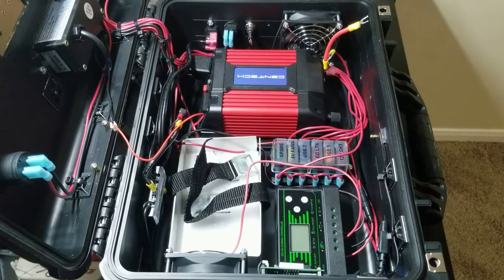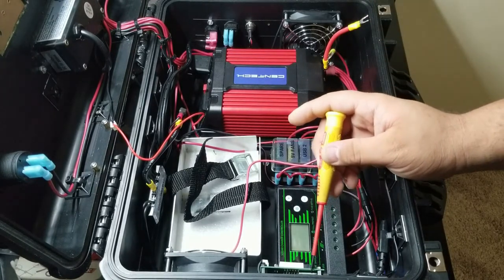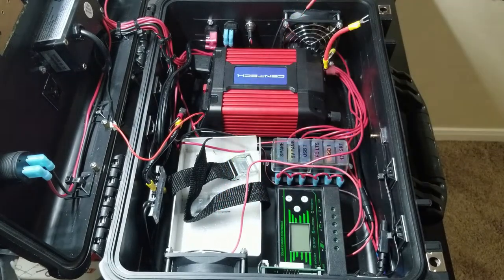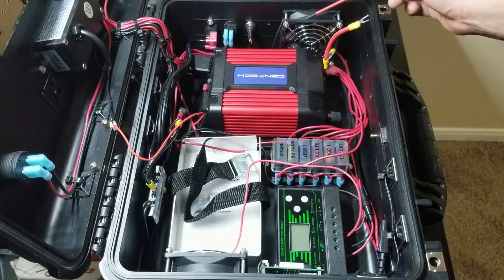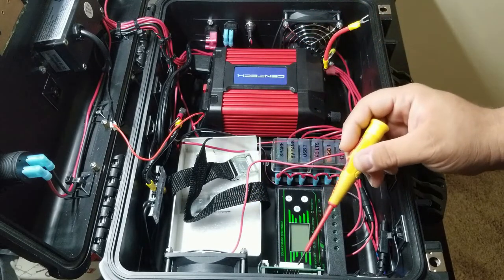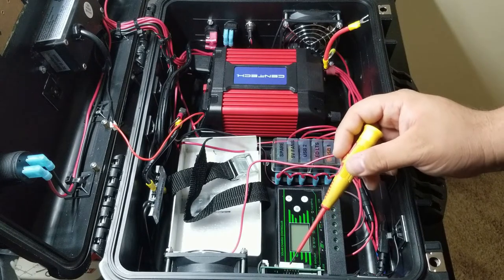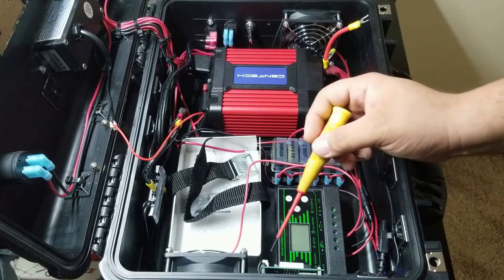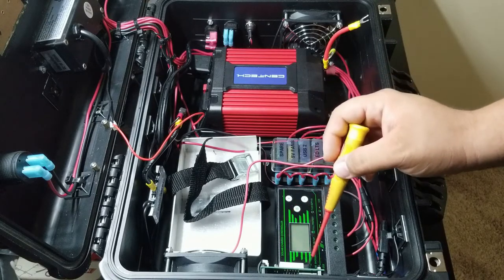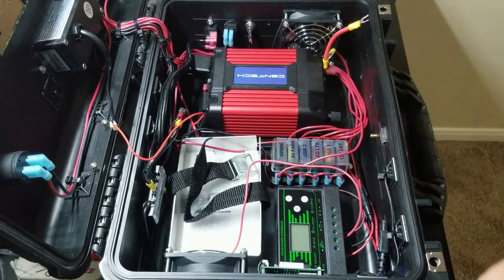The first thing we're going to look at is this temperature switch right here. This is the temperature switch that is being used to turn on these 5-volt fans. This one being an intake, this one being an exhaust. And so this one, it takes in voltage. It has a normally open contactor and you just feed in a wire at a certain temperature. It's going to close that contactor and energize whatever circuit you brought into it.